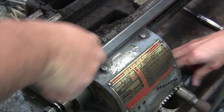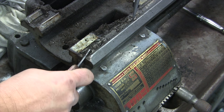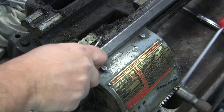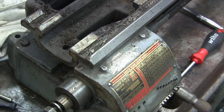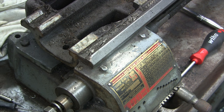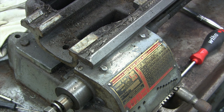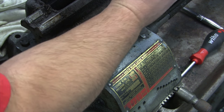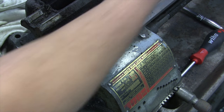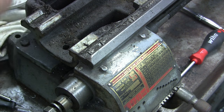We're just digging this out so we could get a screwdriver in there. I'll get the impact for this — make quick work of it. This is one of the rare cases where you've got to use a bigger hammer with one of these. I'm using the solid brass lump hammer. The impact converts the hammer force into a quick loosen.